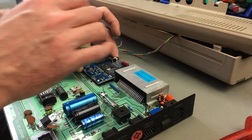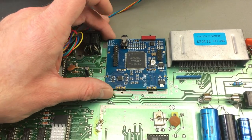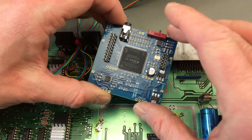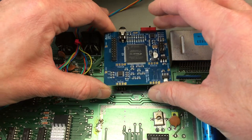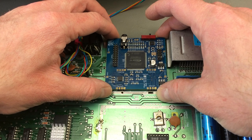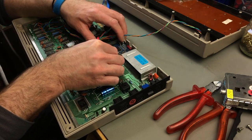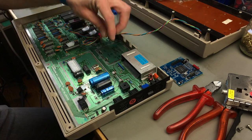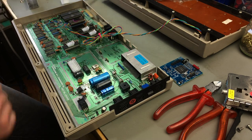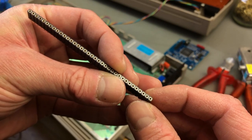Yeah, so we need something to stand this off, I guess. Want this roughly at the same height. Okay, and I just saw that there are little holes for standoffs that actually can go in these holes here. So you would solder on more of the pin headers on the PCB to have it elevate a bit. Yeah, that makes sense. That's nice. So let's see which height this has to go so that the case parts fit, actually. Yeah, it's too low. We can just use like sockets to plug into these. Yeah, that would make sense. I guess I'm just going to fit sockets. So I'm just going to try and fit these sockets there and then plug in the PCB. That would make sense, I guess.